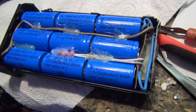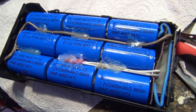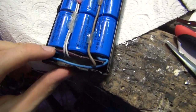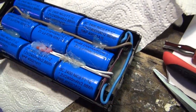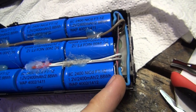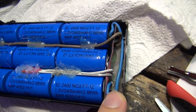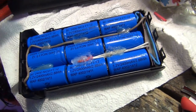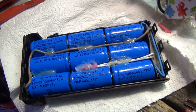So this became a bit messy, I'm sorry. I hot-snotted it in place and put some silicone here next to this thermal monitor device. I also put some rubber strip here in between this little PCB and the batteries to protect them. It's a problem if this little metal strip gets in contact with the soldering pad here, it might short out. All in all, you have to be a bit careful while soldering. These are charged batteries, and if you short them while soldering, that's game over. Then you need to get some new cells, they break immediately.